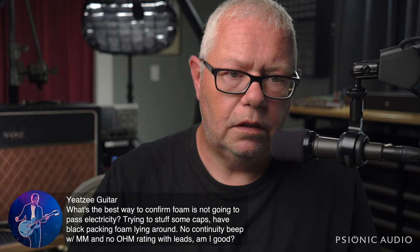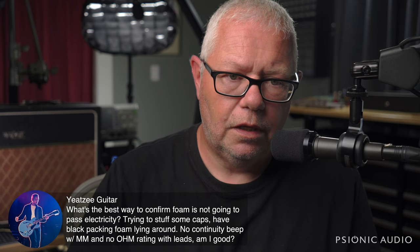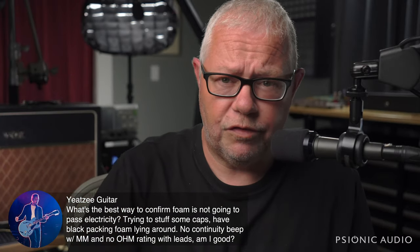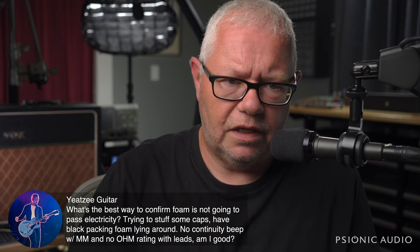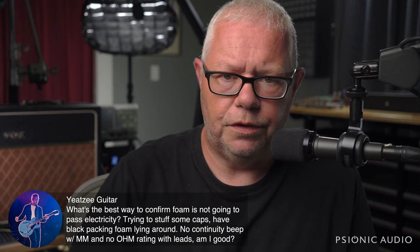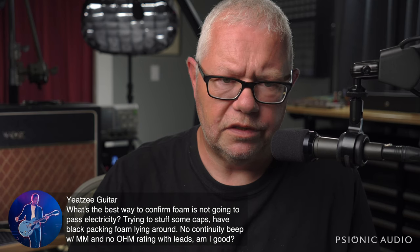You should be fine. Yeah, I mean, trying to stuff some caps. Are you trying to put new capacitors in the bodies of old capacitors? Don't do that. Call me about that, Tanner. We'll talk about that. But if you just want to have some foam underneath a cap, if you don't get any continuity on the meter, here's the test: take some of that material and get it wet and then redo the continuity test after it appears to be dry. That'd be the worst case scenario in a very humid situation.